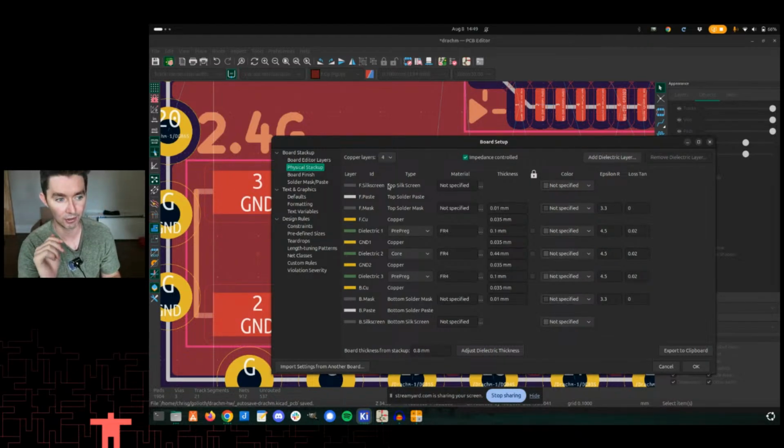Another thing we benefit from is the fact that there is a very short feed line. So if I was running this across an entire PCB, it would be very discontinuous, and is that a word? Had a lot of discontinuity at the start and end because it's a different impedance. Then you could start to have some signal loss there, and your little cell thing might not work as well as you thought it would.